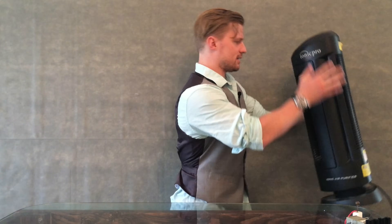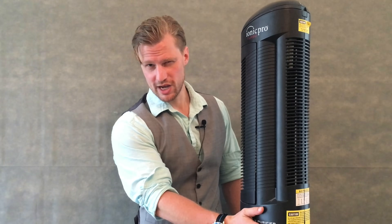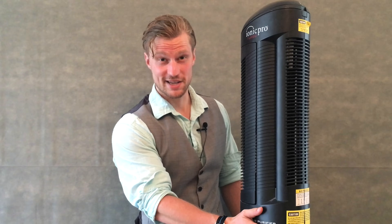So let's go out and find our high voltage transformer first. If you know where to look, they're very cheap and very easy to find. Go out and buy yourself one of these — it's an ionic air cleaner. You can find them at thrift stores; I spent $3 on this one. What we're after is the base, which has our transformer in it. We're going to take it apart.